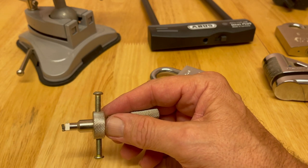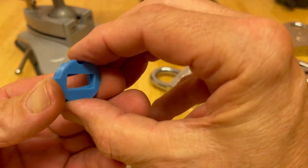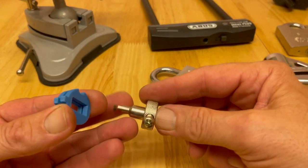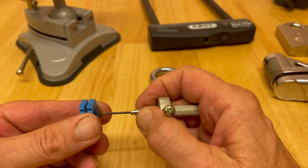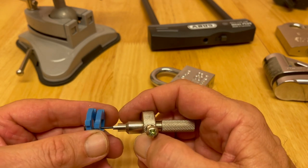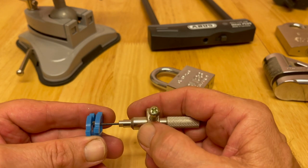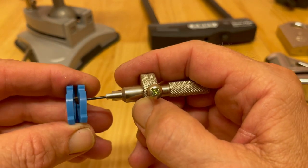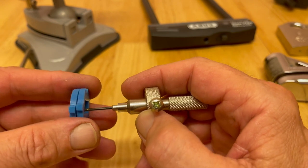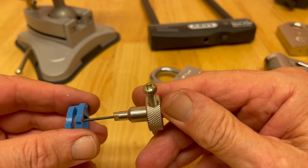When you've got these discs in your disc pack like this, and your picking tip comes in, I'll start at the bottom, and you go up and you pick this disc, so you turn that around to whatever. Once you've got this into the gate, you need to be able to pull your pick tip back between the two discs. There is a spacer, usually anywhere between 0.8 and 1 mil. So you need to be able to get your pick tip between that so that you can rotate it back round to pick up the next disc.